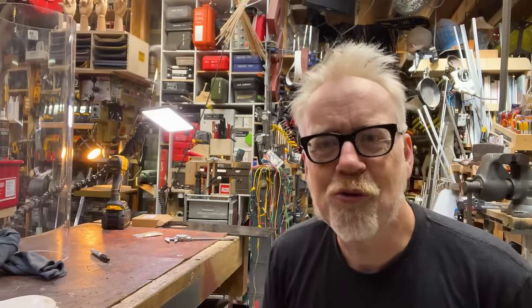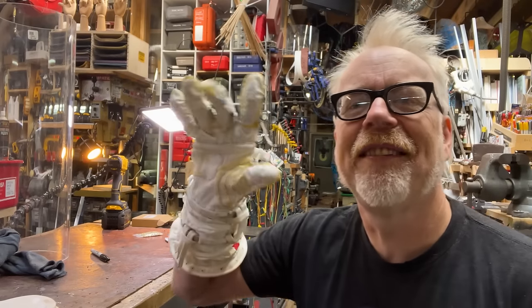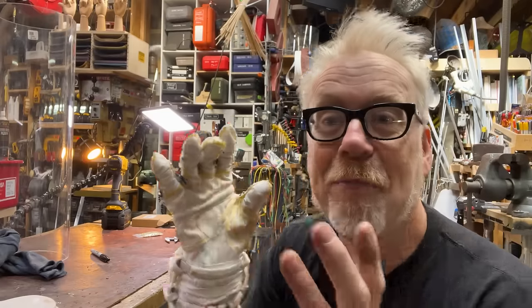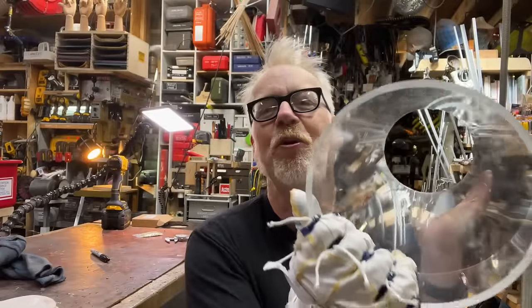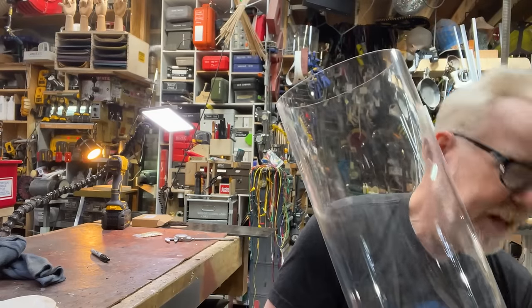But if you want to know what it's like to wear a glove, well, you could put a glove into a glove box, a negative pressure chamber. If I want to experience what this glove is like under pressure, I can either pressurize it from the inside or I can depressurize it from the outside. How do I do that? Why, in one of these, my good man. I have found a beautiful thick quarter inch wall acrylic cylinder that is 8 inches in diameter.